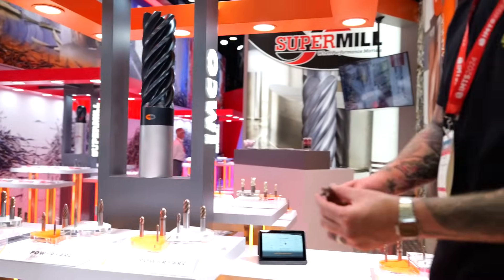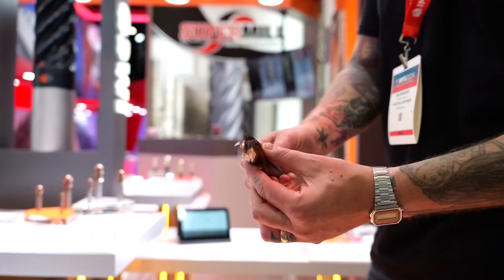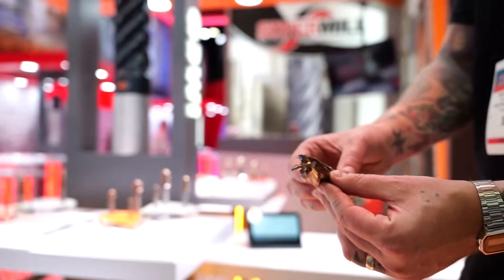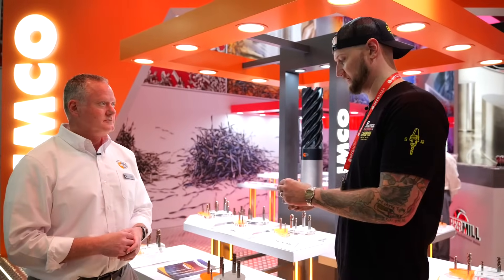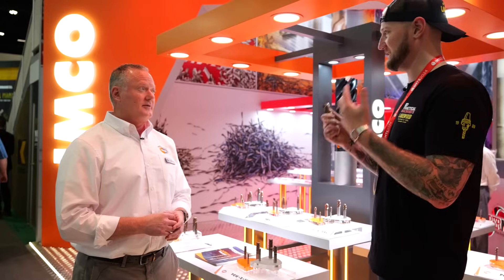Now, a lot of people say, what's so exciting about a four-flute end mill? They've been around since the dawn of end mill time, right? But with these four-flute end mills, combined with the things we learned on the six-flute, that tool is an end mill, it's a drill, it's everything. You can take such aggressive entry moves on that — 60 degrees, 90 degrees straight plunge, like a drill, no problem. And let me guess, especially because that has such a high aggressive angle, although this would go good in steels, softer materials, brasses — this is a real multi-material tool.